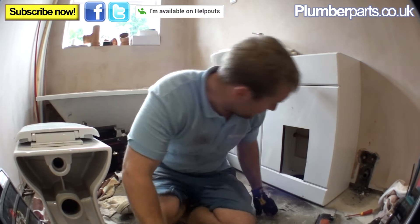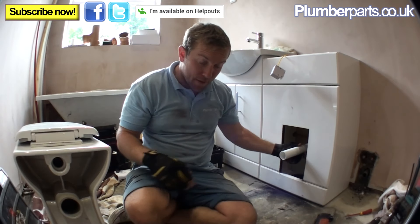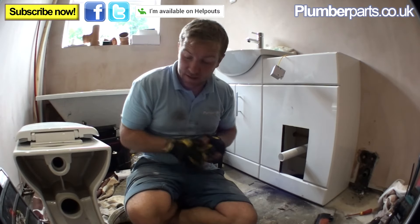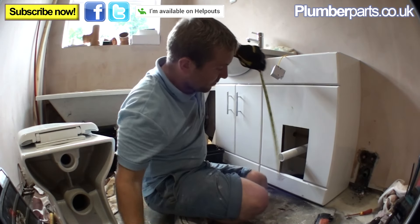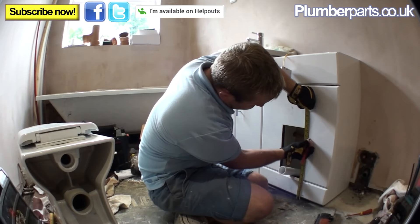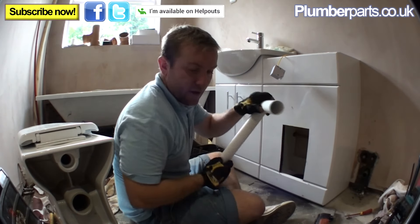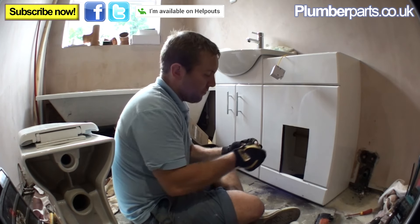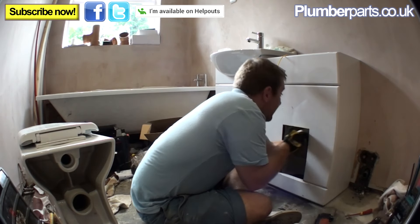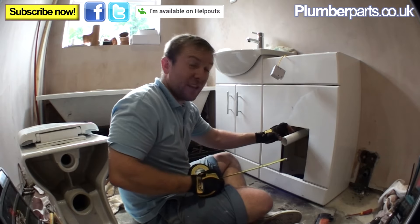What we want to do now is get our flush cut off so it's fully inside our flush unit. It only goes that far up at the moment, so we need to know exactly how much to cut off. You measure from the bottom of the loo up to the centre of the hole — that's 350. What I usually do then is measure up from the front of the hole and mark that as 350 there. Then just line it up — that sticks out 350 there, and then I know exactly where to cut it off. Then I've got my nut on, my slip washer, and my actual rubber washer — push that up and into the fitting. So you know that this is exactly the right height to receive the loo.